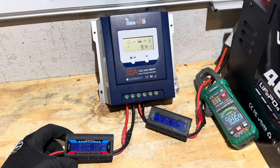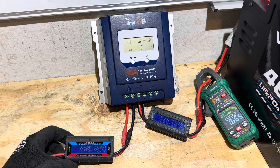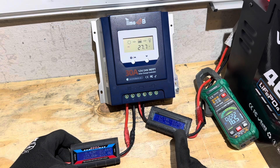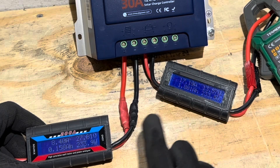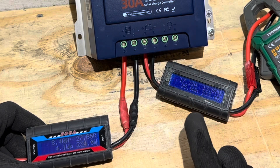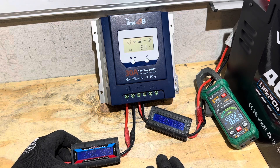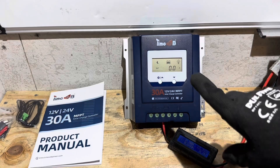A cloud got us — I'm starting to lose the good power now. It's kind of all over the place between the broken clouds, but glad I got that high current draw reading. When we're not at max current, it's actually running a bit more efficient — it was current-limiting itself at that 400 watt mark. Now with broken sky, the ratio of what's in versus what's out is a lot better.